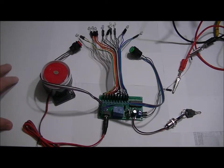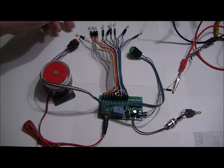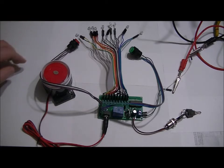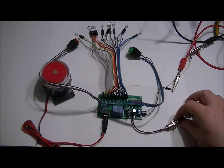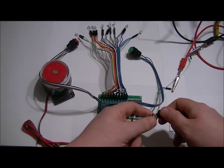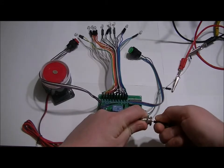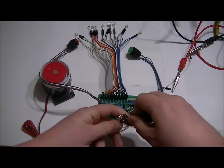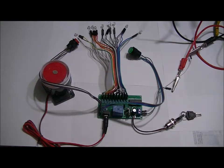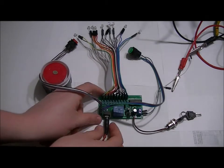This is essentially just an arm-disarm bomb prop. There are two LED buttons, red and green, and ten LEDs — three green, three yellow, and four red. It's essentially a ten-minute timer game. The power is controlled by a mountable key lock — there's a mounting screw — and you can turn power on and off. There's also a loud siren that plugs into the board.